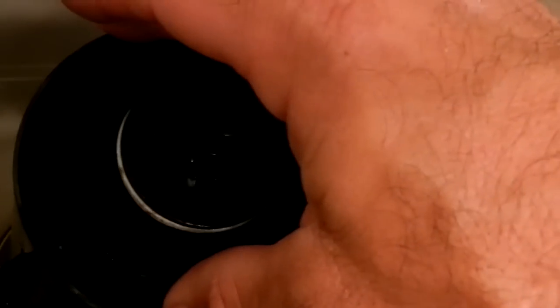You can see I'm moving my finger up and getting my hands up and down, the fingers up and down. That little piece is now in the slot. I positioned it, took two hands just to get it lined up. Be gentle. You don't want to jam, you don't want to break things, because then you've got a screwed up toilet. You have to replace the piece in the tank. You can see that round, or the center post is now inside the little slot that I showed you earlier.